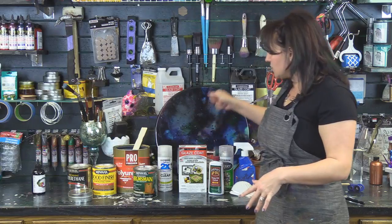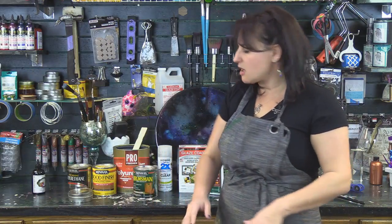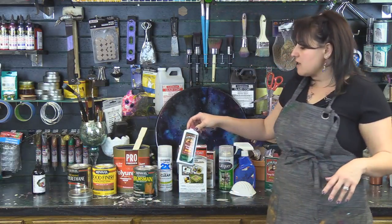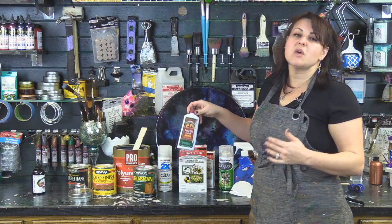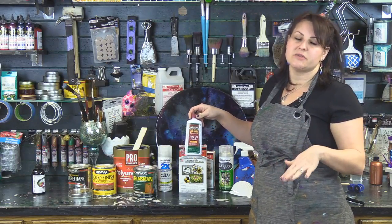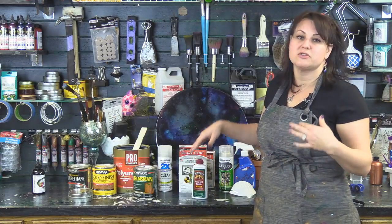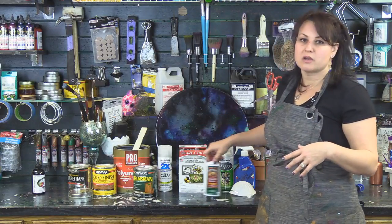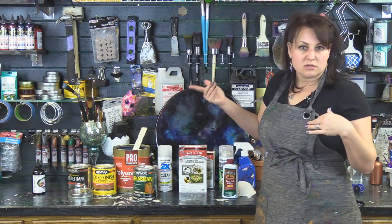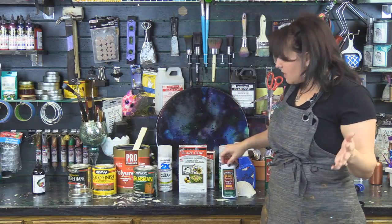If you're looking to get a more rustic seal, like you see here on the top that I just did, I like tung oil finish and a low gloss, but they also have a high gloss. I'm just not so into the high gloss. Nowadays, if I want a high gloss, I don't want to do several coats of polyurethane. I'll just do one quick coat of glaze coat, come back in the morning, and it's like 70 coats flawlessly were put on. Are you ready for some questions?